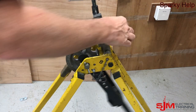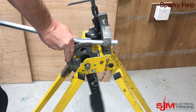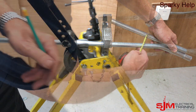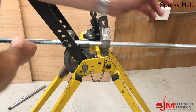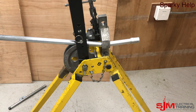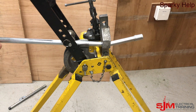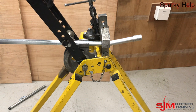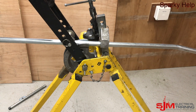You can see it doesn't quite fit — it's not to say it won't go, but it's a bit tight and you'll be playing about with it. So this time what I'm going to do is take a little bit out of the original bend and then do the same again — offer up the 50mm mark, mark that point. Hopefully what you would then do: you can see it's sitting in the stop, sitting in the bend of the first one, which means it's always going to pull correct. Hopefully it's more or less on that mark there, but you can always tweak it. Then you pull the same bend you pulled before.